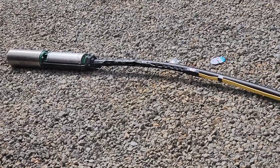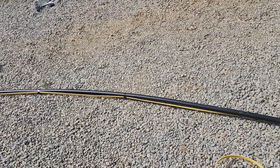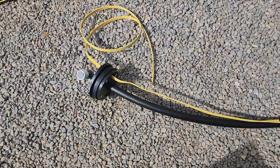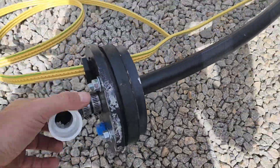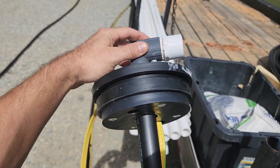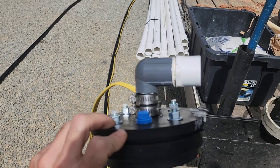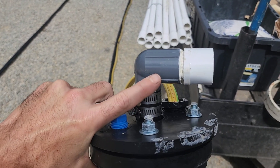Now that I've finished taping up the wire, you can see it's been taped every three feet all the way up the entire length of the pipe — in this case, 85 feet. This is the well seal, and this is how I choose to do it on systems that are 100 feet or less. We use a plastic elbow, two stainless steel clamps, and then we transition over to PVC.